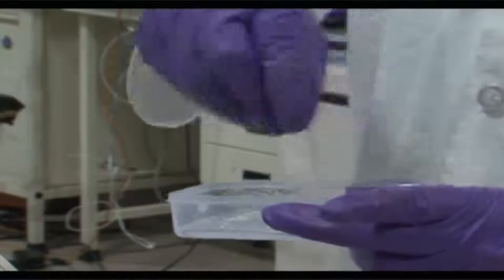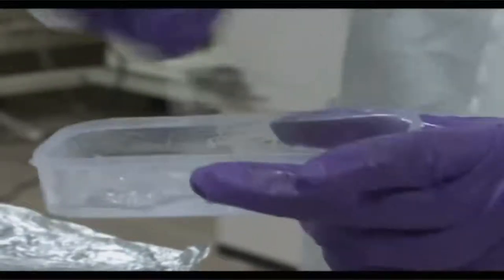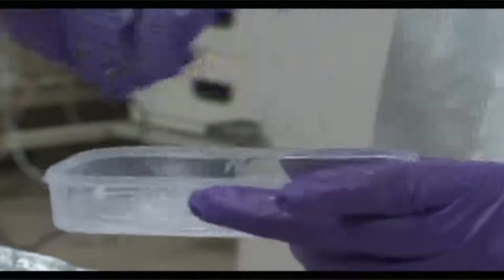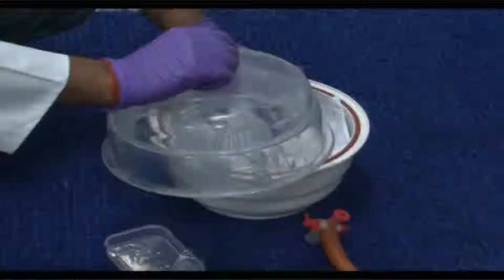And you ensure that the proper mixability is there. While doing the mixing, there is an entrapment of bubbles within the PDMS, because it's a viscous fluid and it has some inertial delay. So wherever there is a scope, there is a tendency of the air bubbles to get blocked and not come out that easily, which involves the use of a subsequent desiccation step which I have already illustrated earlier.